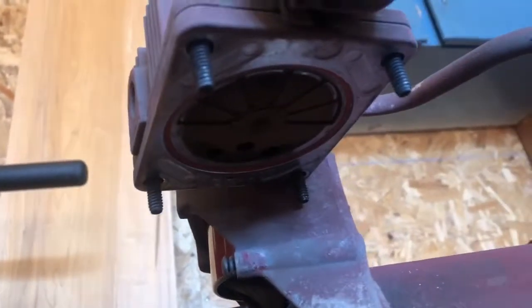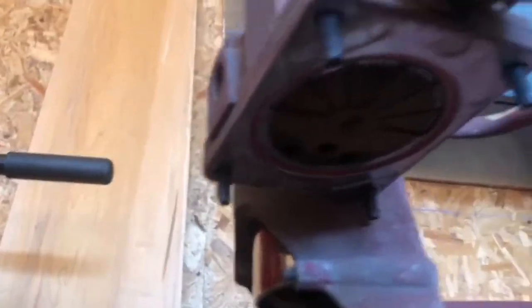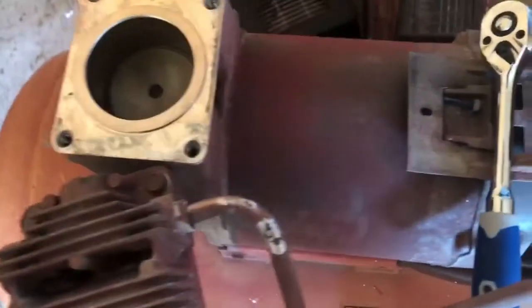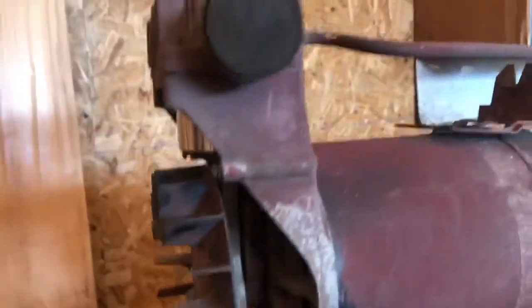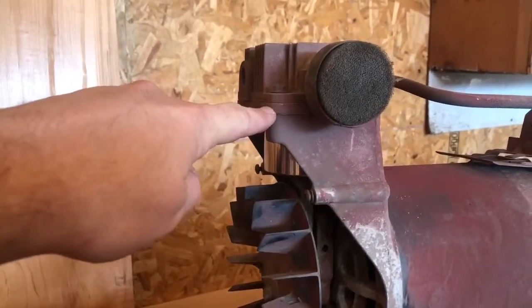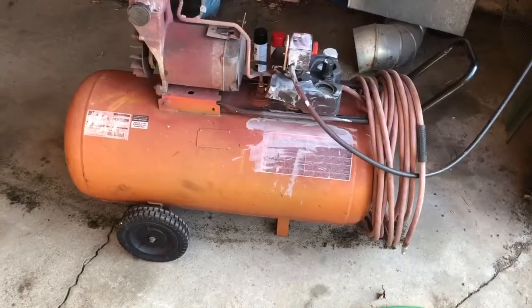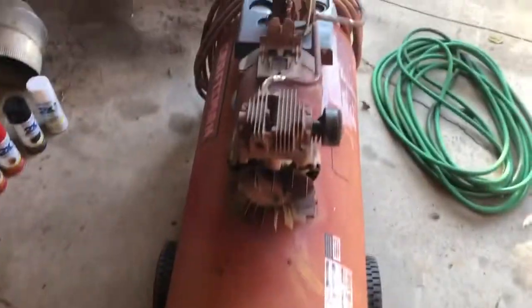There is a little O-ring on the bottom we are going to replace. Now we can check out those reed valves. Whatever. I'm going to replace that seal. All back together. That other seal, I didn't even take this apart. There's the head, and then you got the reed valves here. That second O-ring I didn't use goes in between these two, and the one I did use between these two. All right, I have not fired it up yet. So let's do it.